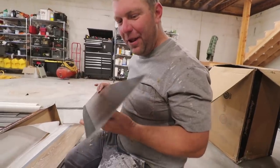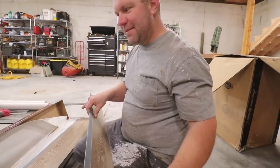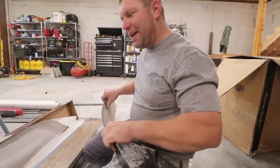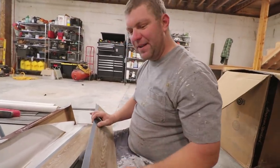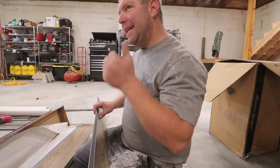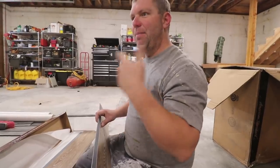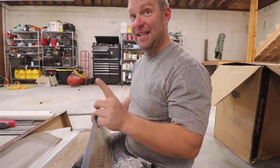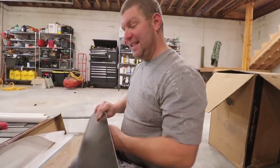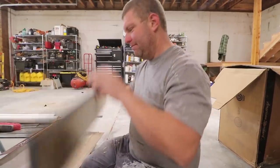So this is a vinyl plank flooring, and it has an adhesive connection mechanism. It's not Pergo, it's not laminate, and it's not click together. It's actually a vinyl product. I think we used this on your rental. We used something similar to this. It was probably higher quality, a commercial grade. It's very forgiving. It's like vinyl in that it's waterproof, but it's unlike sheet vinyl in that you can repair it. You can actually replace a piece. I'm not saying it's easy, but with sheet goods, you're married to it, and a repair can be done, but it is not easy. So we chose to go with plank. Also, we can install it a little bit at a time.